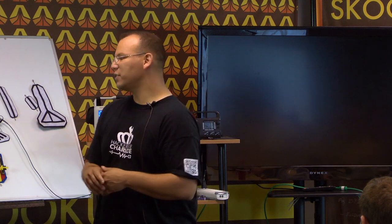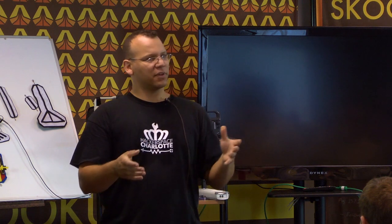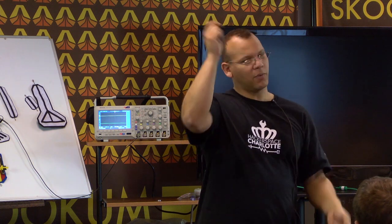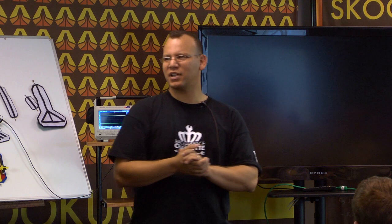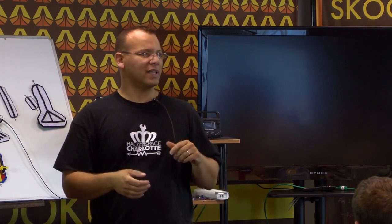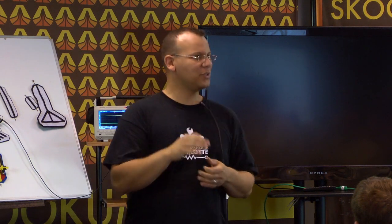But the very simplest of radios, radio receivers, are so simple that troops in the trenches were able to make them using a razor blade, a pencil, and an earphone, and a wire for their antenna. That's all they had available. They would do this in prisons and such when they were captured. And that's all that it takes to rectify a radio signal. And they didn't need to know exactly why it worked, but they knew that it did. Sharpen that pencil and tune your radio.